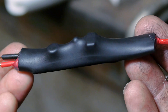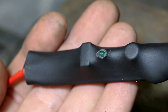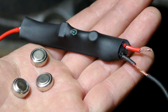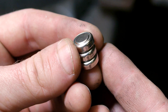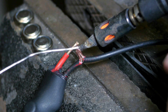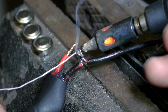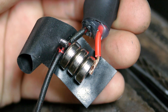There is a power indicator light which has now been covered. I'd like to be able to see it, so I trimmed the casing away in that area. This device was originally made to run on 5 volts from a USB power supply, which I can approximate with three button cell batteries at 1.5 volts each. I'll stack them between my two input wires, and to make that a bit easier, the exposed section of my ground is folded over and soldered into a protrusion that will contact the negative terminal on my stack of batteries.